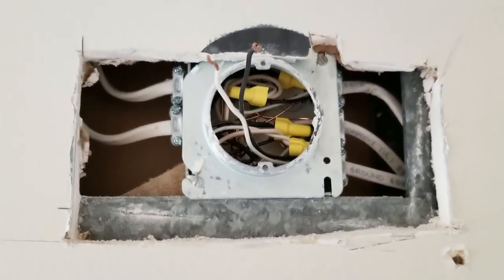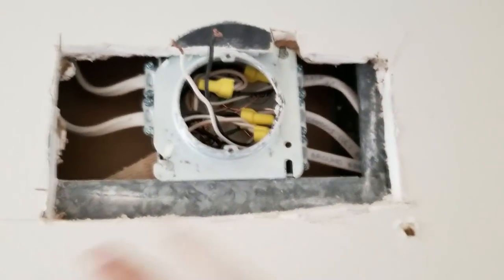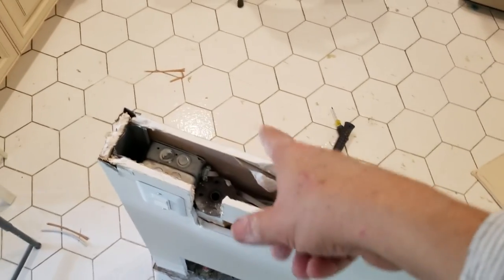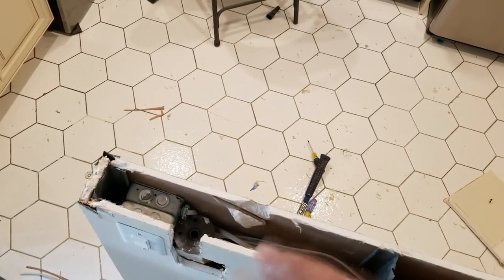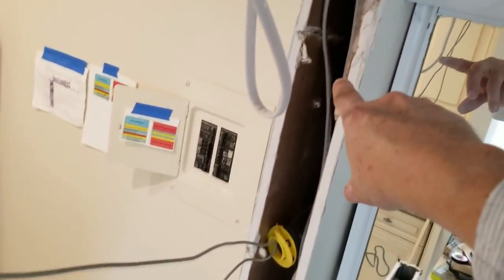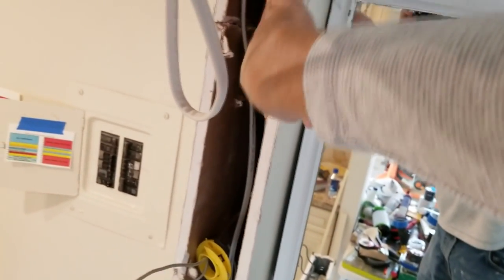It's hard to believe this took about five hours of work to do all of this - rerouting all the Romex cables through the wall and dealing with a huge mess in these two switch boxes. This was a major hub between the dining room lighting, kitchen lighting, patio lighting, and other stuff. And trying to route wires up into this area inside the wall was a nightmare - this is not a standard width wall, they only use two-and-a-half-inch wide studs, so getting your hand up in there to force the wires through the grommet was very difficult.